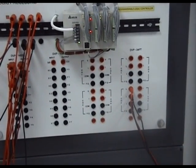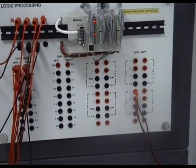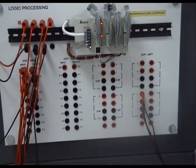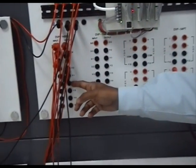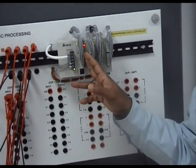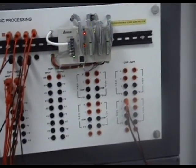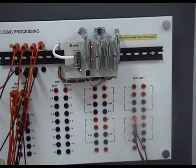We are interested in giving information to channel 1 and seeing whether it registers data. When we give a 4 to 20 milliampere input, it is supposed to manipulate outputs Y0, Y1, and Y2. Y0 and Y1 are connected to the relay, while Y2 is not connected, but we can inspect its output by looking at the LED indication on the PLC or the HMI. We can use this experiment more creatively by taking the output from a pressure transmitter. For the sake of explanation, I am going to use a current calibrator.